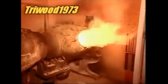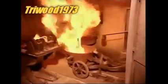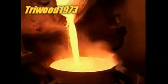The smelter is rotated so that the contents heat evenly. Over two and a half hours, the heavier gold eventually sinks to the bottom, while the impurities, called slag, float to the surface. The slag is poured out, and a sample is taken to ensure it contains no gold. If it does, it goes back in until it's gold-free.